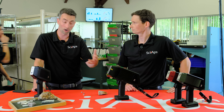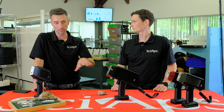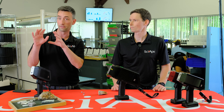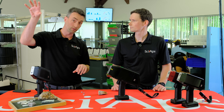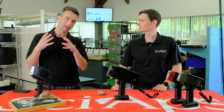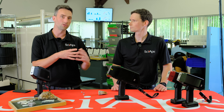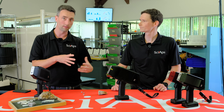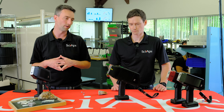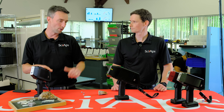Lithium, beryllium — you can get carbon with this instrument, sodium. LIBS, as a comparison to XRF, is really best on the light elements. If you picture the periodic table, the top left corner is where LIBS has best sensitivity. As you go to the bottom right, sensitivity gets lower. XRF is almost the opposite — you can't get the light elements, but you do really well on base metals, transition elements, and gold pathfinders. They really do complement one another well.